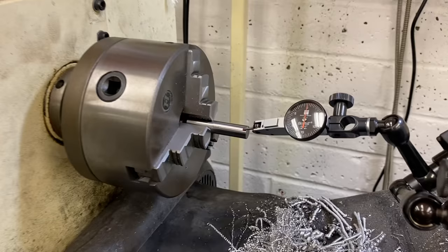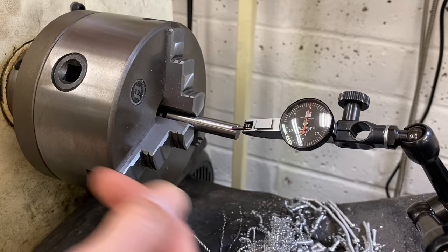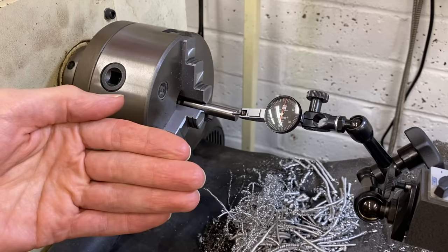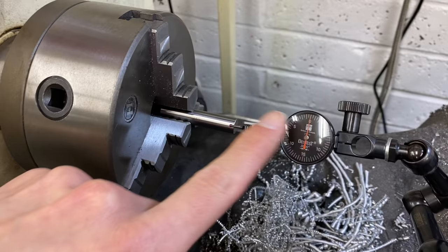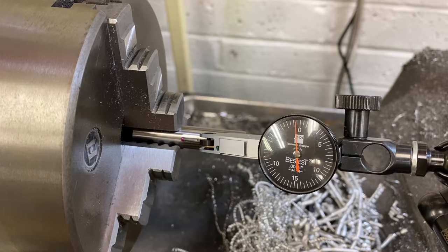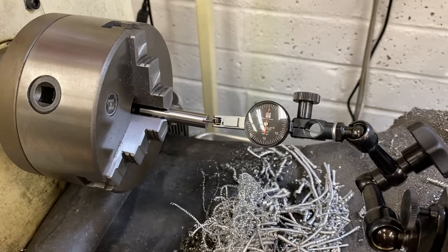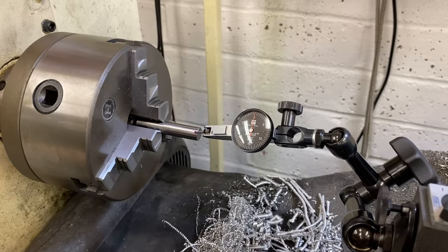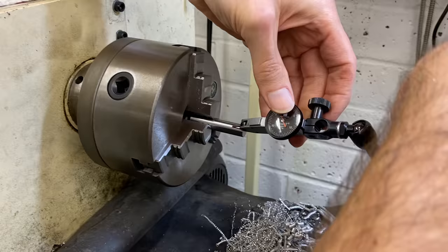Let's take a look at the parallelism — the alignment of the gauge pin to the center line of the spindle. That tells us how straight or perpendicular the jaws are ground to the chuck. Starting at zero on the end of the pin, as I feed in we're getting some drift — about eight or nine tenths of taper worn into these jaws. That's not great, but it's a separate issue that can be fixed by grinding the jaws later. We can work on concentricity by making the chuck adjustable first.